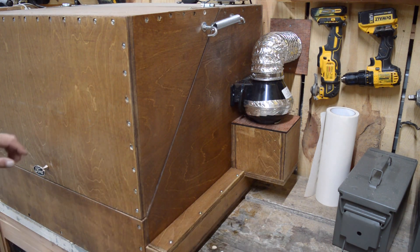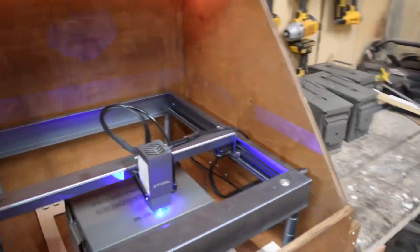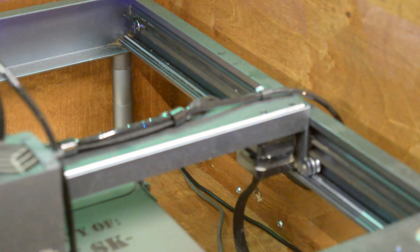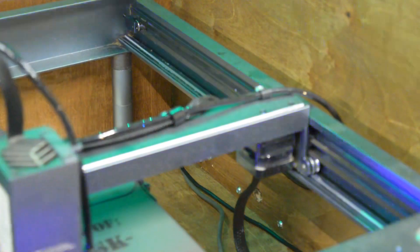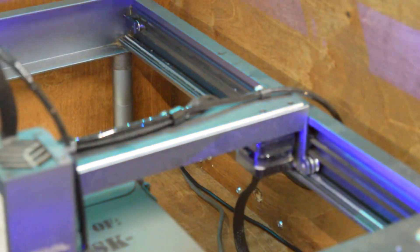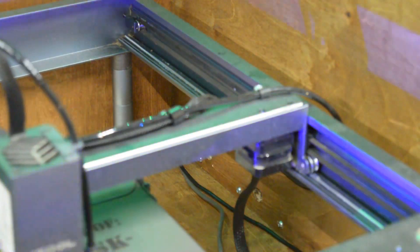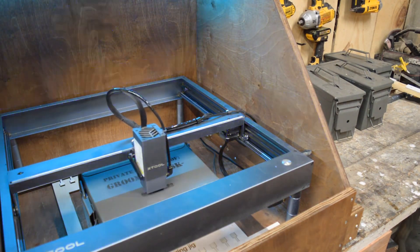Let me move the camera and I'll show you what it looks like on the inside — I do have a job going in here. Now you can smell it guys, that stuff's stout. Right behind the rail there, you can see the holes right above those screws in the back, and they run the entire length of the enclosure from back to front. Those are just little half-inch holes I drilled with a paddle bit. They come out inside that box I built on the outside. The reason I went with this design is because in my other machine there's a false bottom, so I lost about an inch or two of depth. I didn't want to do that with this machine because this is my tall-item machine, so I decided to go with the ductwork approach. It works and that's what I was after.